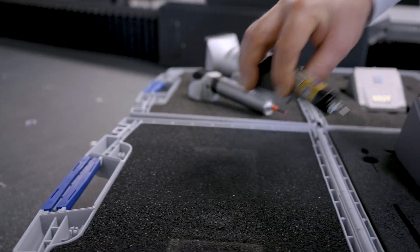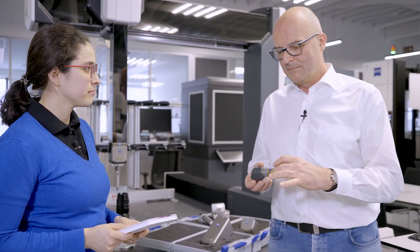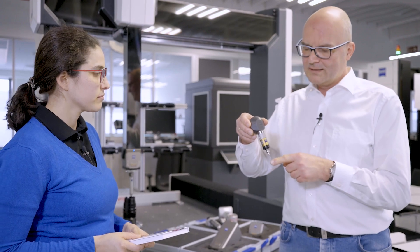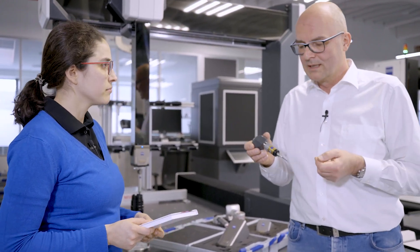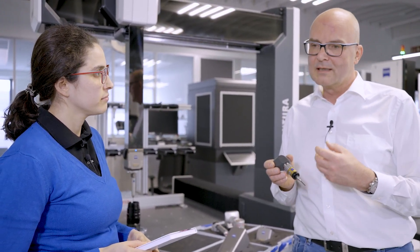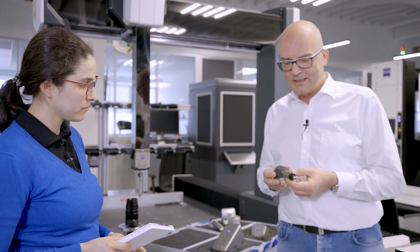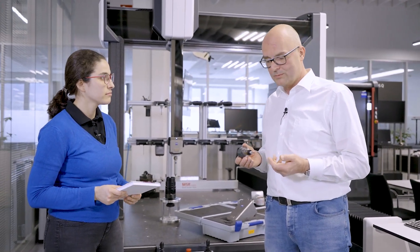Coming to the first sensor, the touch trigger sensor — the principle inside is relatively easy to explain. There are three locations, three bearings, and they are oriented in a 120-degree orientation. When you probe, so you do the touch point, you get a deflection of the probe, and this deflection is determined inside the sensor — then it's a valid probing point. Even more, in our system, the RSTP, we have another sensor inside which guarantees a little bit higher accuracy for the single probing point. But it is a touch trigger point, so it only gives you back some probing points, and you have limitations in length and in the weight of the probe — for instance, if you need star probes or L-probes, it's not possible to do this.